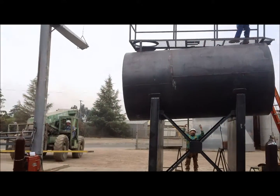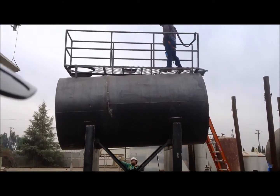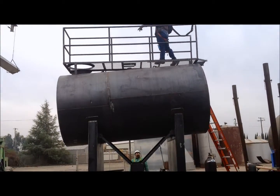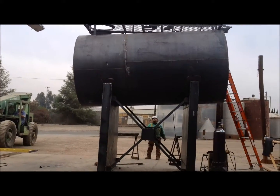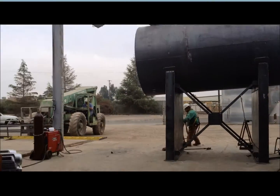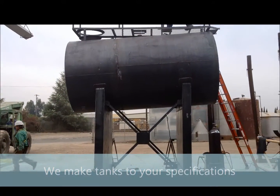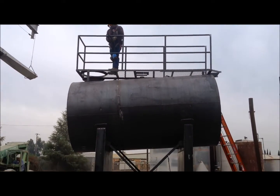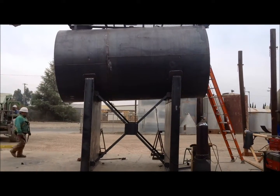What we have here are two tanks we're building for Caltrans. They will hold hot asphalt emulsion — it's one of the tank types we work with, and we have large projects ongoing. This is a 3,000-gallon tank. They asked for it to be sloped so the hot asphalt has an automatic gravity feed on one end. We also fabricated a catwalk on the top. That's the ladder that's going to be connected to it, and for transportation purposes we make the catwalk removable so it can be shipped and reassembled on site.